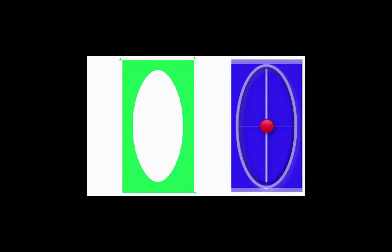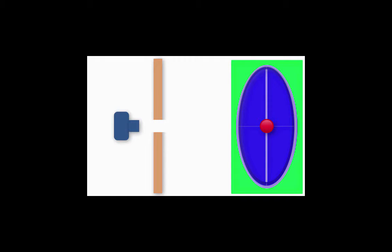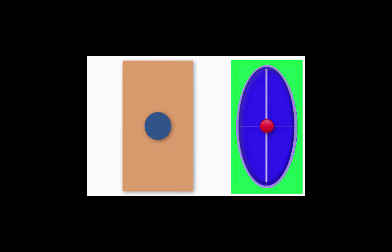So first we add a small cone to the center of the blue plate. Then, we add another ellipse-shaped spacer. Then we take a plate, pop a hole in the center, and mount a driver. We can use many different kinds of drivers, including compression drivers. Now, let's stack this all together. If we were to slice this vertically and look at it from the side, it would look like this. We can now trace the sound path through the Paraline lens.